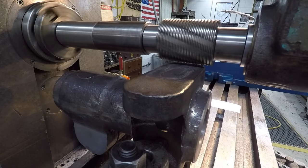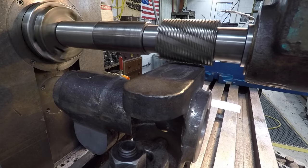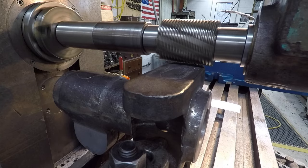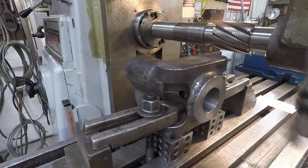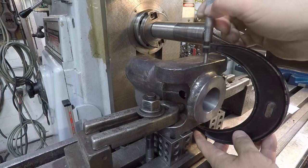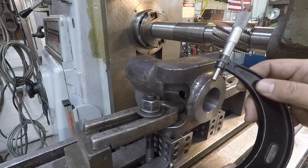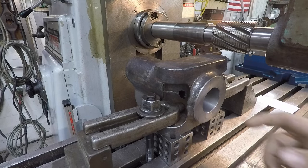All right, we're gonna raise it up till we touch. I'm right up there at it now. All right, we're just touching there, so we'll back off. So I'll be able to use my 4-5 mic. This distance that we want to machine to is gonna be 4.5 inches. And we've got approximately 150 thousandths to come off the width there. I'm at right at 4.650, so about 150.